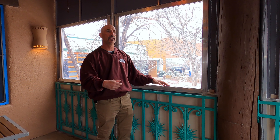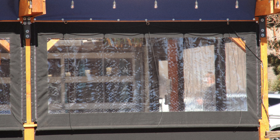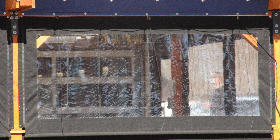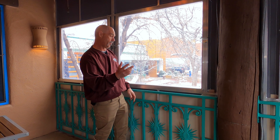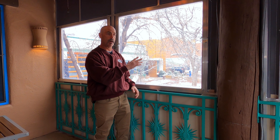With the rope-based system where the clear vinyl is sewn into the body, the whole panel has to come back into the shop to be unstitched and have a new panel put in. Another big problem with clear vinyl is that it shrinks. As you can see from these photos, there are lines around the perimeter of the glass — that's from the vinyl shrinking and bringing the fabric with it. Once the vinyl shrinks, it puts a lot of pressure on the zippers, making them very difficult to operate.